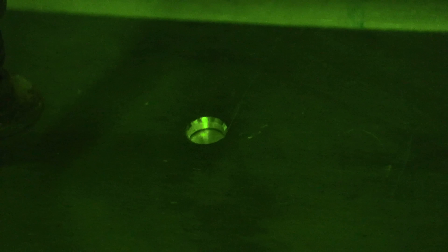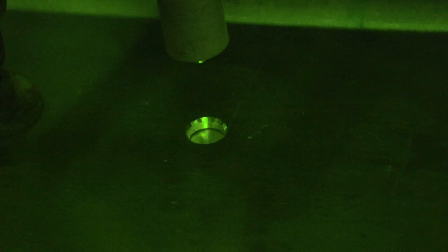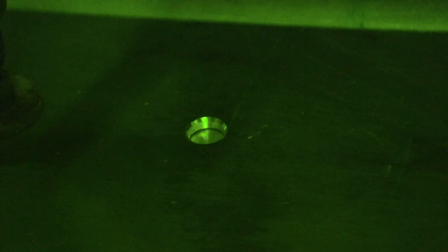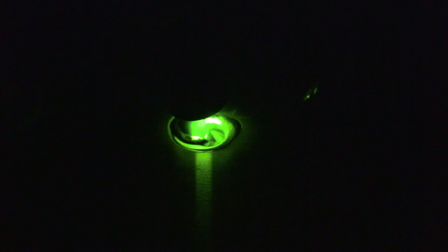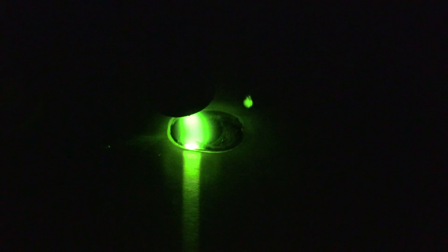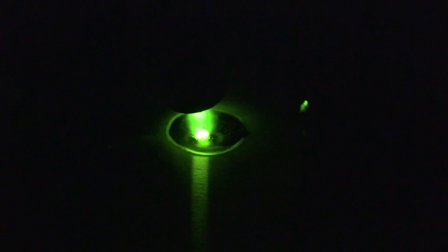Zoomed in on one rosette that we're going to weld and fill — you're going to see me hold the arc and I'm going to hold it until it actually rolls the top plate down in and merges with the lower plate, and I can get the lower plate to actually glow in the center at the same time. There — it went down and caught. Now I just add a little bit there. I roll it around so that it will fill and join just like that.